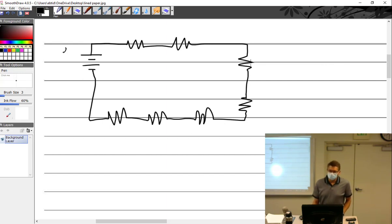So if I knew for a fact that I had, let's say, 10 amps flowing through there, and I wanted to know what the resistance of this is, would the easiest way be to take it all apart? No. What would be the easiest thing to do? Find the voltage drop. Measure the voltage. Well, that's just crazy talk. Yeah, it is. Because if I measure the voltage, and let's just say it happened to be 2 volts, how am I ever going to figure out what the resistance is? Ohm's law suggestion. How much would it be? 0.2. How hard was that?